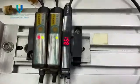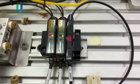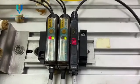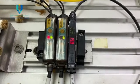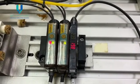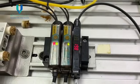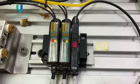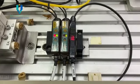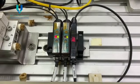Optical fiber sensors have unique advantages such as high sensitivity, immunity to electromagnetic interference, small size, light weight, flexibility and the ability to provide multiplexed or distributed sensing. Keyence's FSN series of fiber optic amplifiers allows connection of more than 100 types of special fiber units. It has various features to improve stability, such as an automatic maintenance function that automatically compensates for dust and dirt build-up. A flexible optical fiber enables easy installation in limited space, such as space between machines.